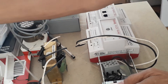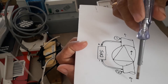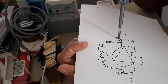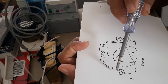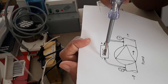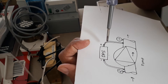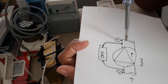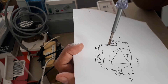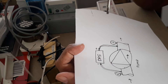I have a small drawing here. Let's say this is the pump — you have to look for the flow direction. In the pumps you can always see a pressure gauge installed on the discharge side and one on the suction side. You will install your water DPS so that the negative side connects to the suction side and the positive side connects to the discharge side. To set the differential pressure set point, you need to observe the pressure readings when the pump is not running, then run the pump.